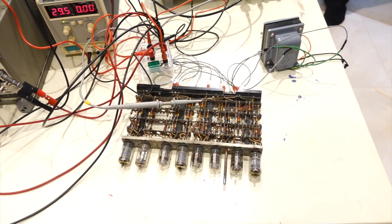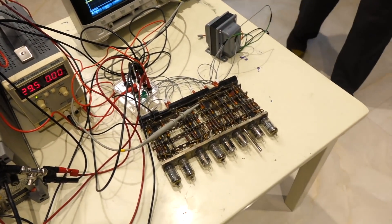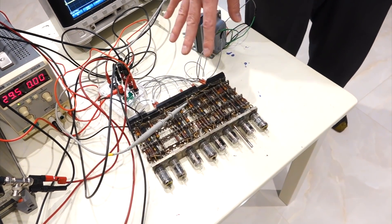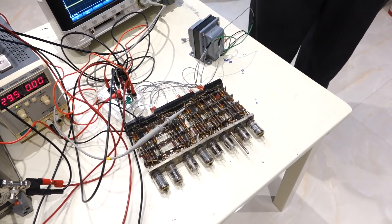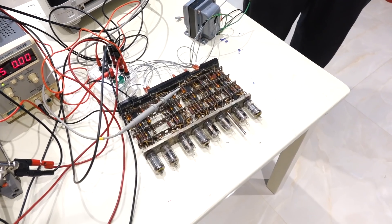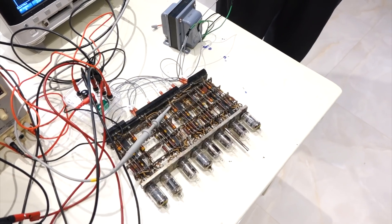This has more than just one debouncing circuit, right? It has five. Can you explain what the tubes do here? Five tubes are used for the five debouncing circuits, and then those go to five cathode follower buffers, which use half a tube each. So that explains the other three tubes. There are two tube types, both dual triodes. We are only going to test one section, because a few resistors have fallen off over the years. We'll repair that later when we have the full computer.